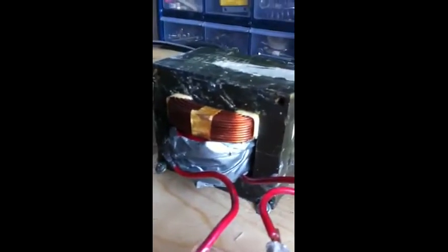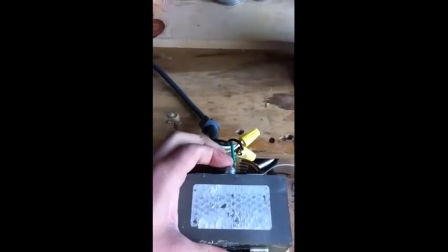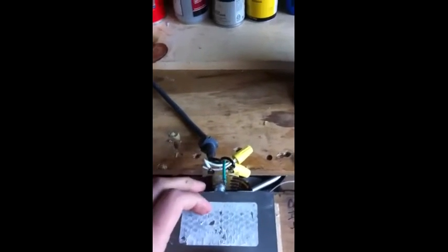So I rewound the coils, and that ended up being much neater. I got the two sections back together, epoxied them, and clamped them very hard in a vise. They closed up and now they're all good. I also made sure to take the ground wire coming out of the microwave oven transformer power cords and screwed it into one of the holes in the transformer core — I drilled one out and forced a screw in. I did the same on the other one with a slightly different hole.